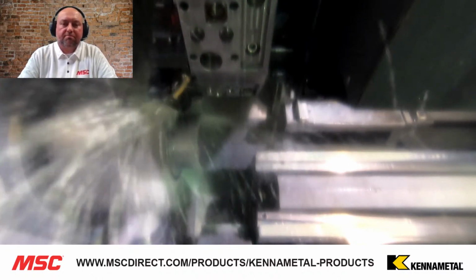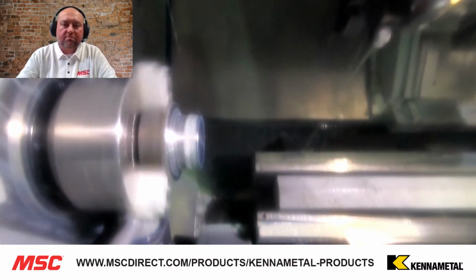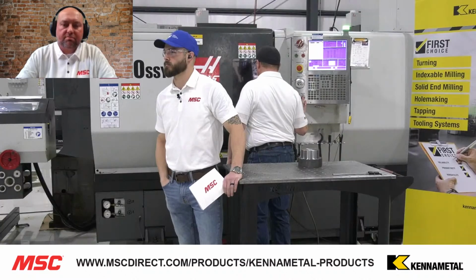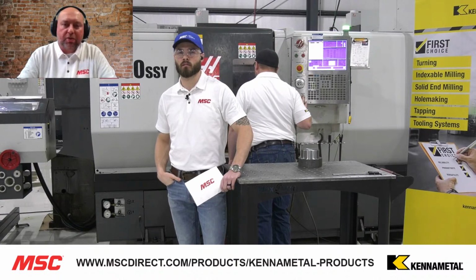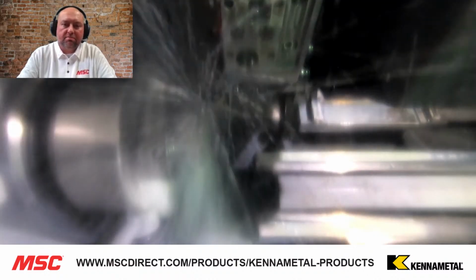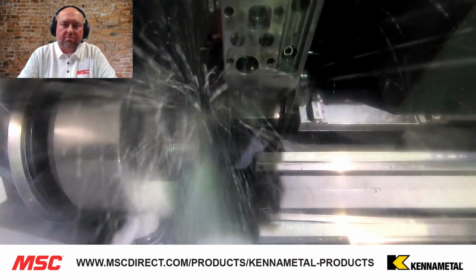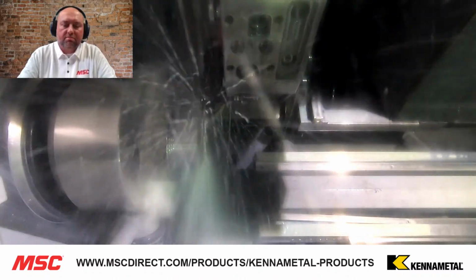Solid stuff here. And then obviously we got this new school method. Are there any other specific items about the old school method, as we've seen demonstrated here, that we'd like to highlight? I believe, Aaron, if you jumped over to the finishing yet, are we doing that now? Yeah, so I just finished the rough turn. Now we're finish facing right now. And then as soon as this face pass is done, we're going to finish the OD of this part.